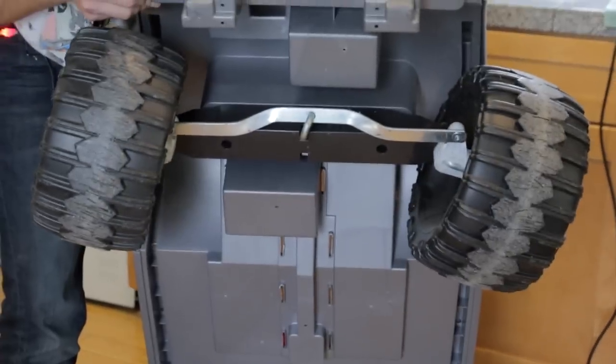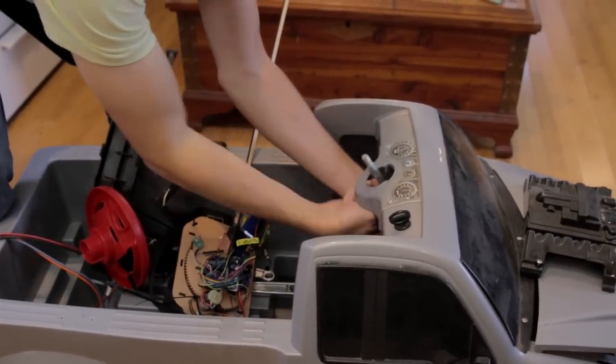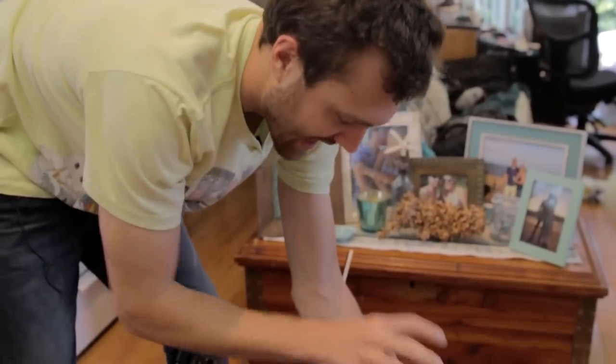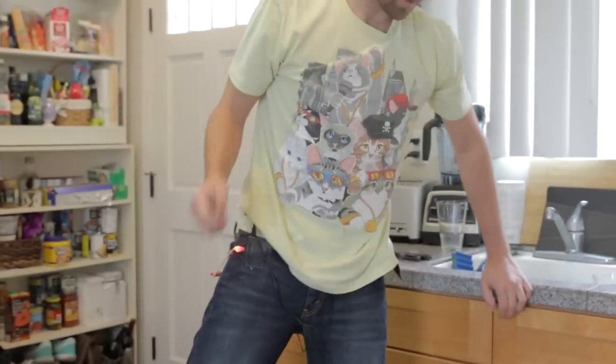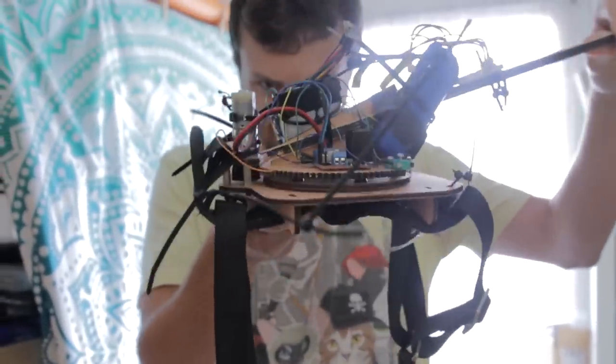What we're gonna do right now is work on the steering. We're gonna take the steering wheel off, attach a laser-cut gear, and then mount an encoded motor. We'll encode the whole thing so we know where the steering wheel is, then write software that tries to make the steering wheel move to the right position based on your controller input. It's going to be very similar to the dog robot.